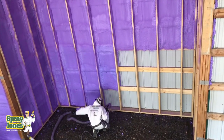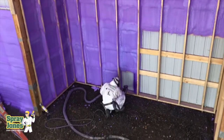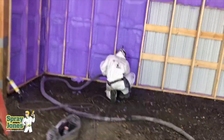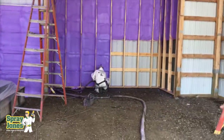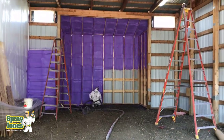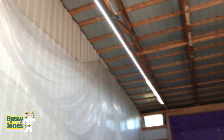It's just very different from an old two-by-four wall where it's difficult to see. If you have an old home with balloon construction, sometimes those walls are 16 to 18 feet continuous — going all the way from the foundation level up to the rooftop. So how are you going to stop the foam? Where are you going to start? How are you going to build sequentially to get all the way up? You can't do it in one shot, in three, or in five. The technical issues on this are pretty monumental.